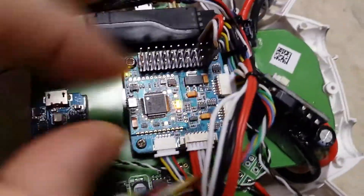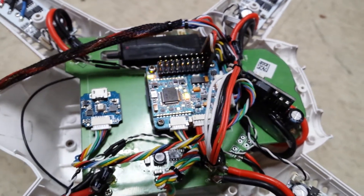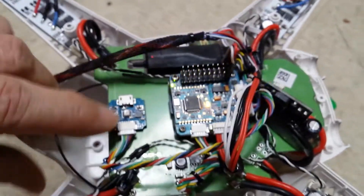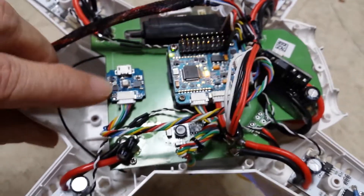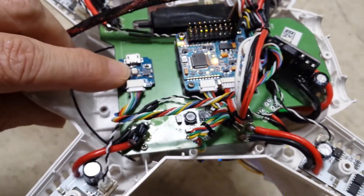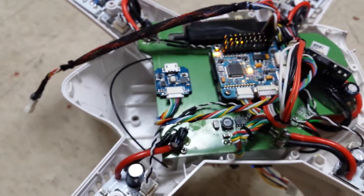That's where I'm at so far with the wiring, but there are going to be some massive changes coming up when I get this new board in for the LED. I'm going to be replacing this board right here with another board that doesn't have a compass — it just has the LED and the USB. The LED on it is a large SMD LED. If I were to take it off, it has six contacts under it, three on each side, and they're micro — there's no way to solder wires on that without pulling the pads right off the board.